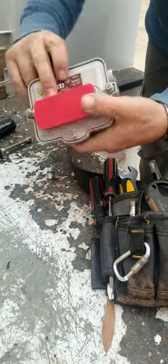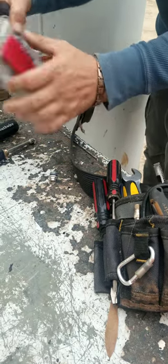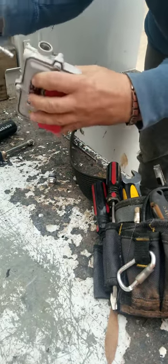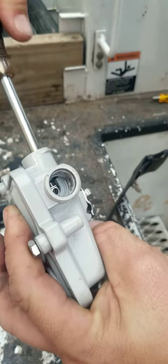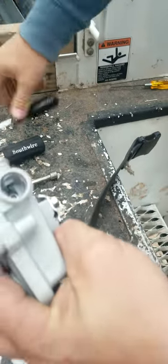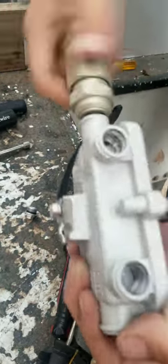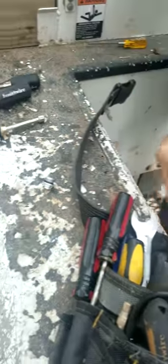So let's say you guys are doing apartments or whatever, so we're going to put it like that. So your connector's going to go this way, so you have to move the seizing screw the other way. Open it up. All right, look at that. We already measured and cut, right? Correct. So it goes in a little hole, and the seizing screw locks it back down after you tighten it.